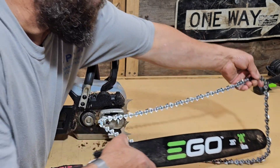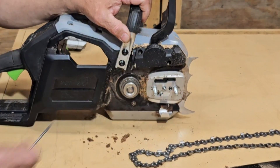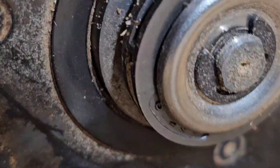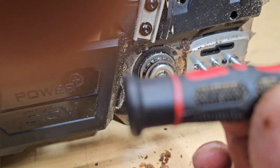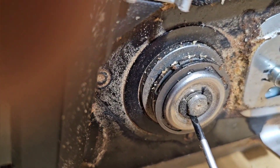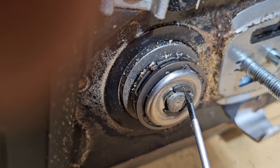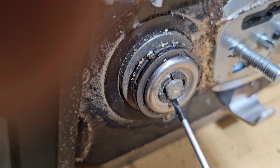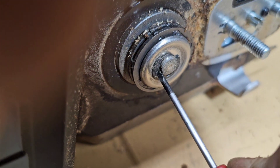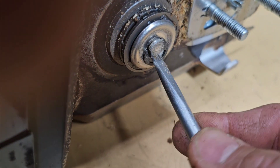There's a little snap ring here and we're going to take this — I'll give you a close-up on how to swap this ring. See that snap ring? I've got this little screwdriver — I think it's from Tractor Supply or Harbor Freight, nothing crazy, but it's rugged enough and small enough to fit right in there. I just twist it and that snap ring comes right off. I'm going to try to aim that down so it doesn't shoot away.